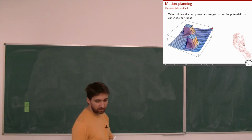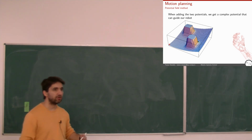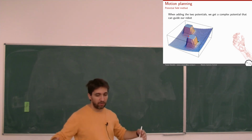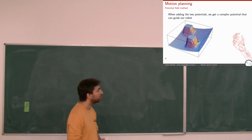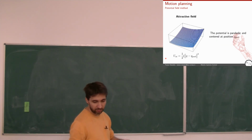Anyway, the idea is that you have an initial point and then you do some numerical optimization to find where the optimum is, and you usually go from one point to the next, the next, the next. But this optimization avoids fields where you have very big values. So that's why it's used, and it gives us an optimal path in a way. Now, if you want to include energy efficiency and so on, you can construct more complex functions where, maybe in this region I have an uphill, so I can include that to make my optimization try to avoid it. And other complex situations that you might want to include in the function and optimize. This will give you a mathematically optimal trajectory, while these methods will not.